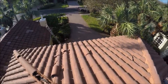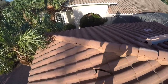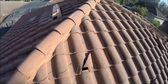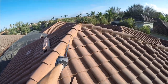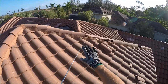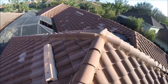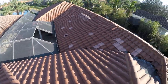You can see some more broken tiles here on the ridge and in the field. Now when it comes to trying to repair this, because they don't make this tile, nothing will actually fit in here because they don't have a profile that will fit. So what you have to do in order to repair a tile, unfortunately, is you have to go up to the ridge and the perimeter and actually do this section of roof. That way you have a breaking point and you don't have to worry about the tiles lining up exactly. So each section that does have a broken tile in it, we will need to replace that section.